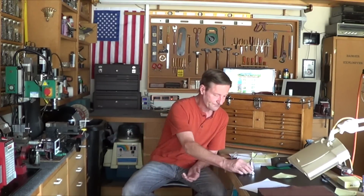I turned it to that diameter on the money, and you could just turn it around and around. And it goes, oh, quiet. You can see the pitch or the pattern did not move. So that's kind of a heads up. If you manually turn the lathe over, rotate it, and you see the pattern traveling, you are not going to get a good knurl. It cannot move.